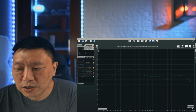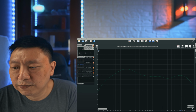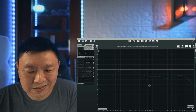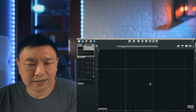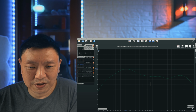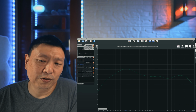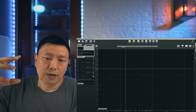Now on the top range, you will see that it peaks out at about 7.5 kilohertz, and following that, it will just tail off. Now, I've smoothed it out so it looks like that. It doesn't look like it is a very bass capable speaker, because you want to hear 50 hertz, you want to hear 45 hertz before you think that the speaker is going to sound great in the bass department. But trust me, when you're listening to this guy, you will not find bass lacking because of what is known